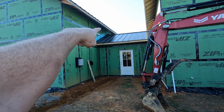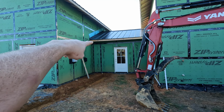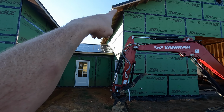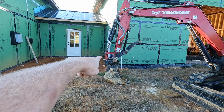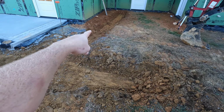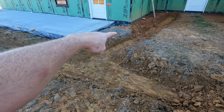So right up there toward the peak, I'll let that little breezeway catch the house water, come over here to a downspout, we'll come down with a downspout there, we'll catch this half of the garage, we'll run it down right here, 6-inch tile, come out here, and then I'll tie my French drain into that system, so I'll be able to catch all this runoff water on the groundwater.